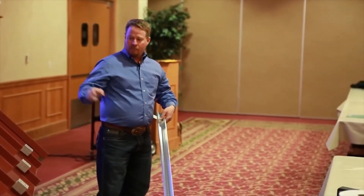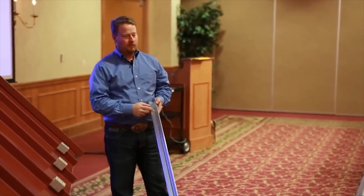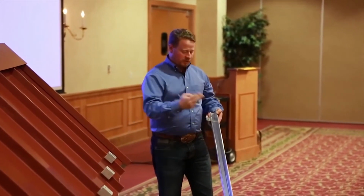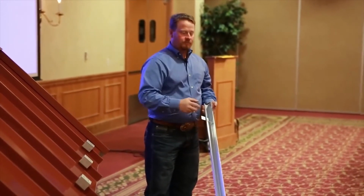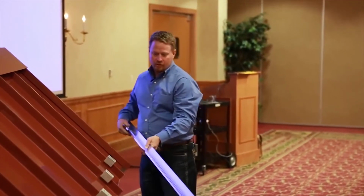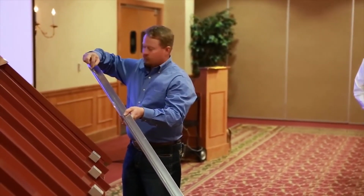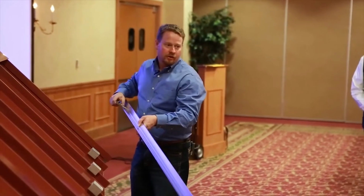Even if you have a panel that's laid out true on 4-inch intervals, a lot of times they'll get out of module, and so you'll find yourself that after 20 feet you need to cut it to get your holes to line back up. This, you never have that problem. In addition to that, the VersaClip will allow you, with punched ColorGard, when you put it in place, you have no room to pivot. Or if you were wanting to go down a valley, this will allow it to pivot on the clamp. So you can install it askew, where with the punched ColorGard you cannot.